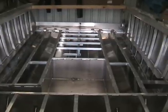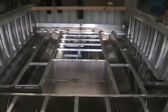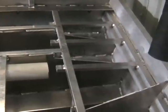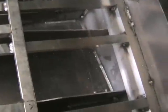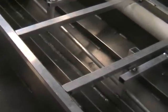There were also 100mm stringers just running up the section there, just under the fuel tank void, also bracketed to the back of the transom. There's the 5mm longitudinal bulkheads tying in with the transom. Just there you have your 100mm stringers, also supporting the floor, giving it strength, running to the transom. And when they get to the transom, they're also gusseted.